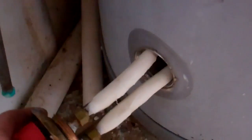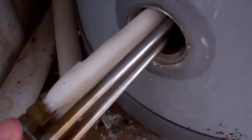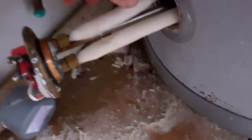We're changing this element in this water heater for a tank wash. It heats all the water up so it can do a hot wash. This was fitted by another company about three weeks ago apparently. That's how much scale it's built up. I don't think the previous element lasted very long either. In fact it's got so much scale on it it won't even fit out the hole. Apparently it was three weeks ago, but it might have been a bit longer — it's quite severe, isn't it?